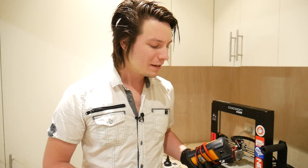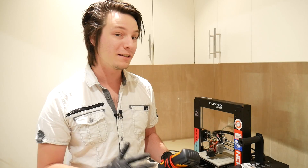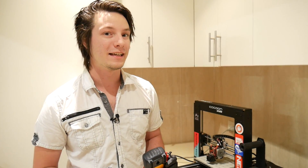Also keep in mind we have a higher voltage here in Australia — 240 volts AC on the mains versus overseas where it's about half. Basically these machines are designed to operate with ground; they have a ground pin for a very good reason — it keeps you safe. I'm going to be using that fault detector on all of my ports from now on to make sure they are properly grounded. Please go watch DIY3Dtech.com's video explaining in detail why grounding your 3D printer is extremely important. I'm glad to get to the bottom of what actually happened, and I look forward to moving on and printing awesome things. Thanks for watching guys — hope you found this useful and I'll see you again very shortly here on Makers Muse.